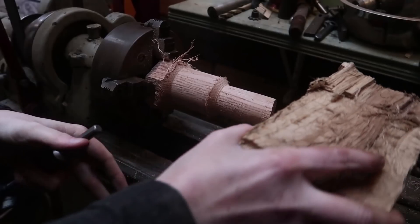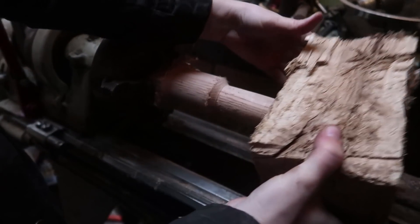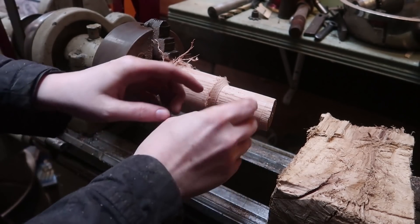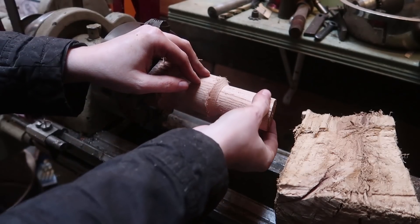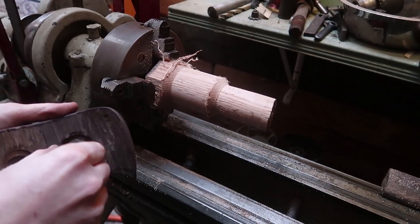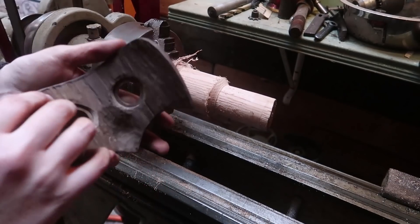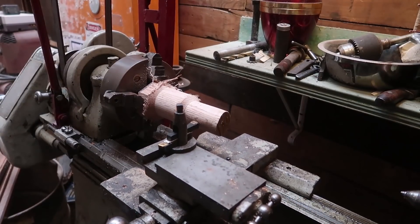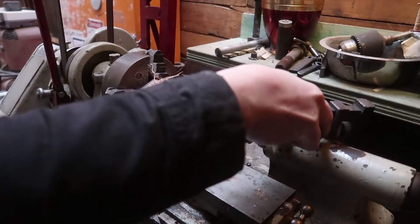This is like a plug that it will sit on to align it. I've made it to where it fits well enough, although if it has shrunk it might be a bad fit. I adjusted my cutter and so this is actually slightly conical - it gets smaller. We're going to be cutting the indentation for it to sit into my drill press. Then with this second piece I want to make a tool so I can push cloth into the back of this mask that I'm making, that I hand carved, and then glue it up properly with the proper tension.